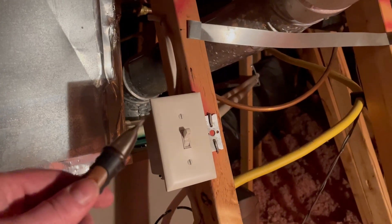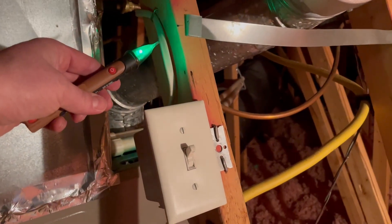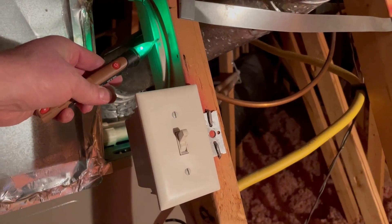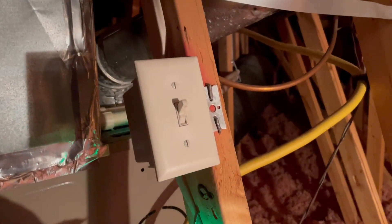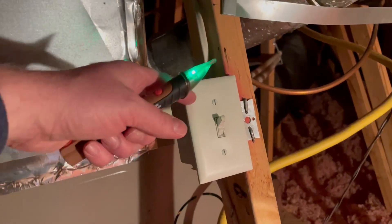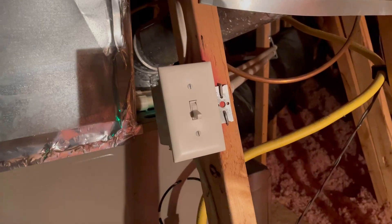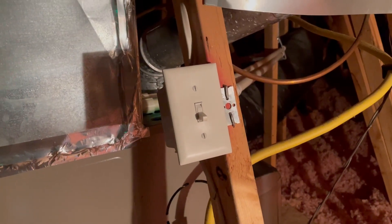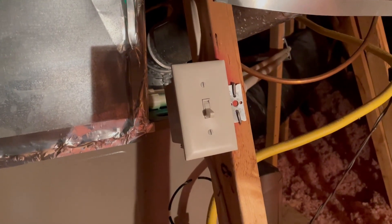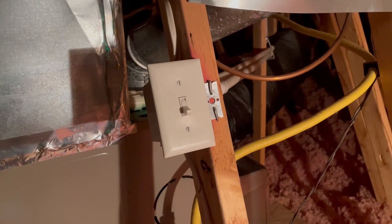I trust my mapping of all the circuits, but better safe than sorry. So I'm going to turn on my AC voltage detector and check. Moving it to the top — nothing. That's exactly what I want to see, nothing flowing through the switch, and nothing going down to the bottom either because there's no power. I always flip off the switch as part of my sequence, so I'm still going to turn the power off to the furnace right here, then open everything up and take a look. See if I see anything obvious — a blown fuse or something like that.